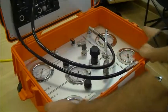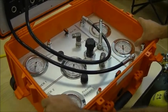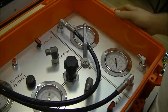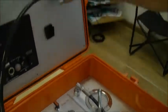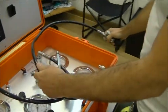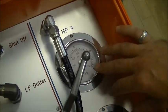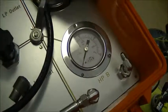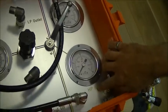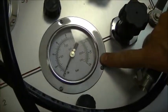Here is what you have on the inside. The ACM has a basic configuration and many different optional ones. You have two HP inlets with two high pressure hoses for going to the tanks. You have two relative high pressure gauges with double scale — BAR and PSI. You have the switch handle to choose between using air from tank A or tank B. Then you have the pressure regulator.